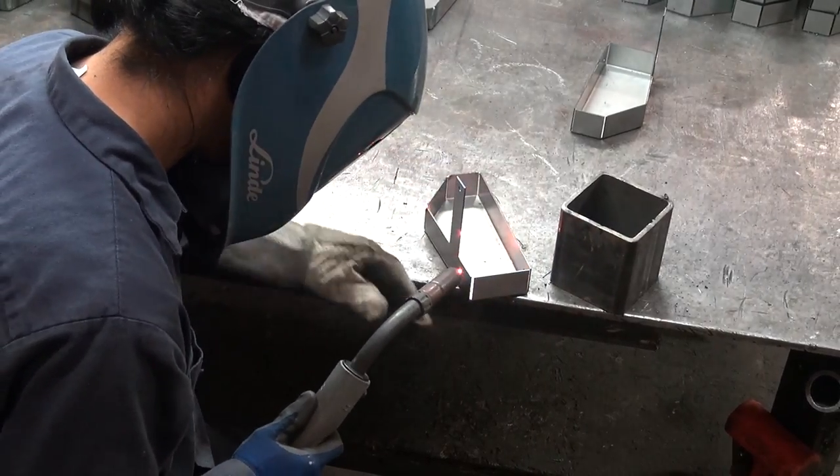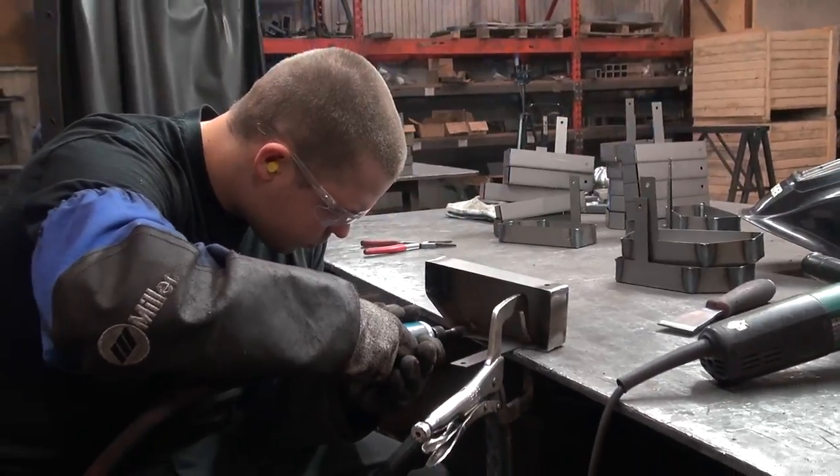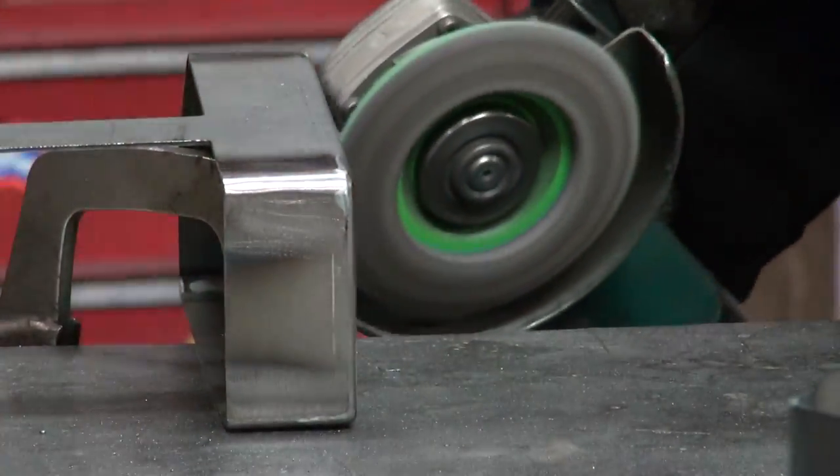This product is made of sheet metal and it's been powder-coated. We've gone with a powder coat because it gives it a very nice aesthetic finish, and it's also very durable and sturdy. A lot of steps go into this: once it's been cut, it needs to be folded; after it's been folded, it needs to be welded together. The holes need to be drilled, it needs to be sanded down to give it a nice round finish and take away all the sharp edges. After that, it needs to be treated to remove all the oils from the metal, and then it gets powder-coated.